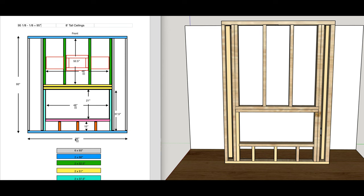Next you'll have to choose how wide you want your fireplace. Mine is five and a half feet — 66 inches — and that fits a 50-inch fireplace pretty well, giving a good amount of space on both sides. You may need to adjust yours, and in that case you'll adjust some of the other measurements accordingly, except for the rough opening, which is dependent on the specific fireplace you choose to install. Now we'll get into the actual rough opening and the framing needed to insert the fireplace.